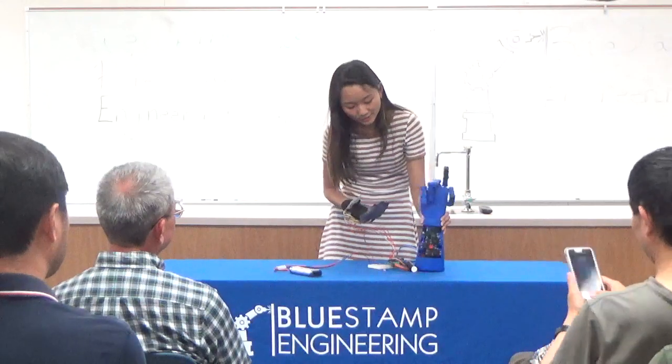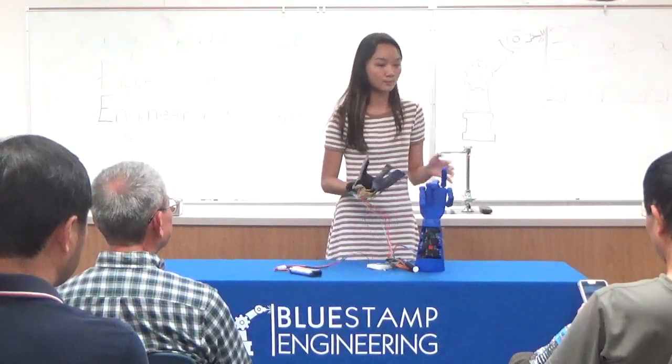There isn't enough space in the forearm for a 5th servo, so I had to drill a hole into the side to make sure that the wires didn't break. I also had to use a Dremel to cut down 2 of the servo horns so that they wouldn't clash when they rotated. But because of their smaller radius, it made it harder for them to pull the fishing line, so they lost some control over their corresponding fingers.